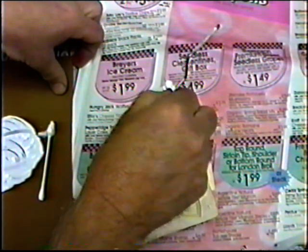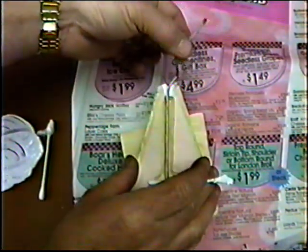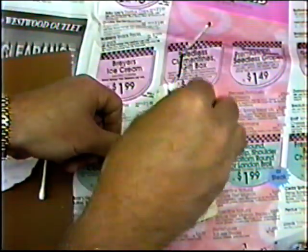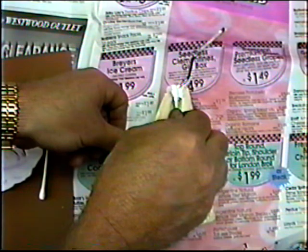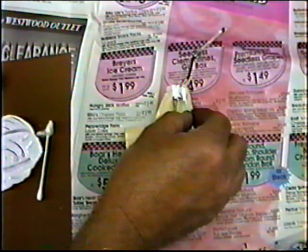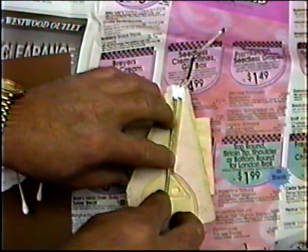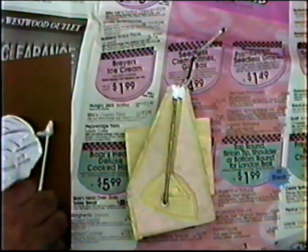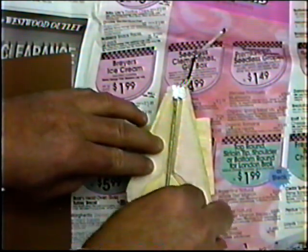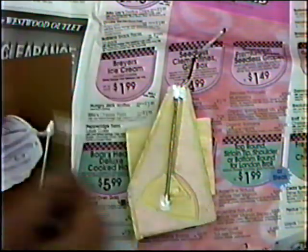So that when we fill a mold with the resin, and we'll use a high-strength resin, that'll tend to seal it off. And then I can just take this off with a knife. Again, it's RTV silicone rubber, so we're going to sand it anyway, so there's no point worrying about release agents right now. I want to get that wire to set down, and I want to check the 90 degree. And that hopefully will seal that up.